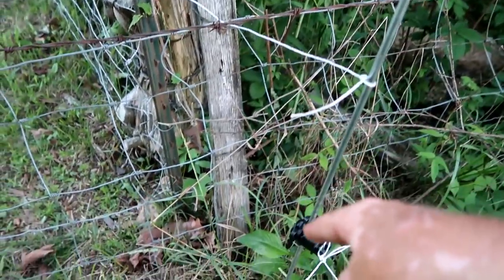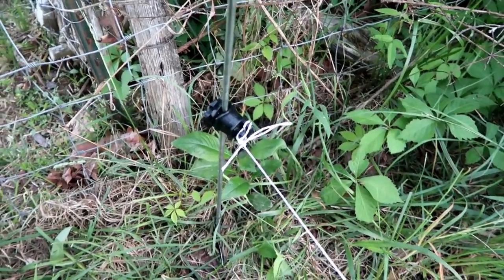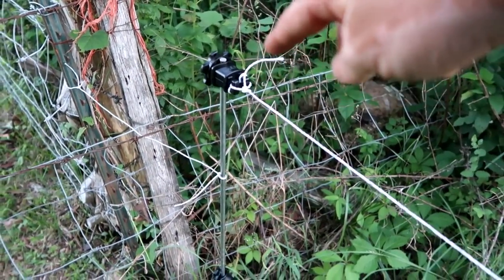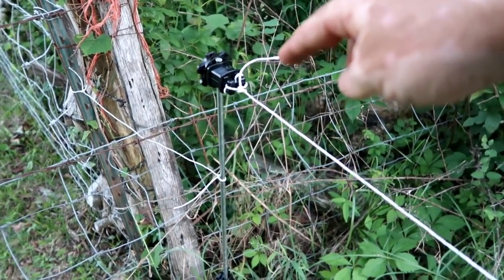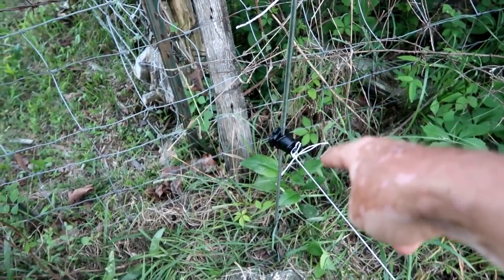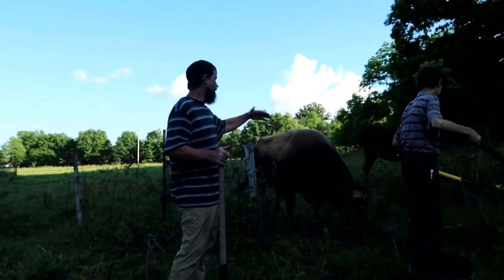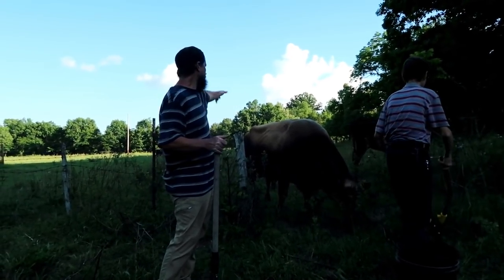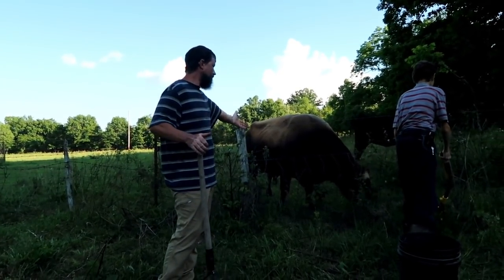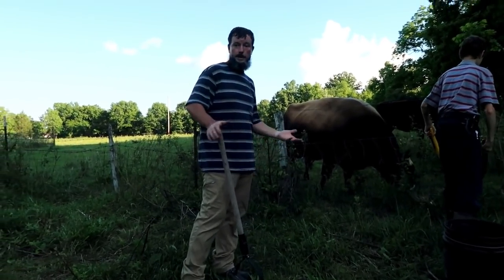The ticking was because this wire where I tied it off was touching the metal, and that metal is going to ground. I was very careful not to do that anywhere else but somehow missed it right there. When it's disconnected at the gate there's no power to this whole line. We're going to put a gate in right here so we can easily let the cows go from that pasture to this pasture. You can see the cows are in that pasture munching away.